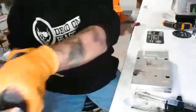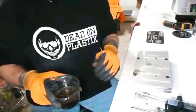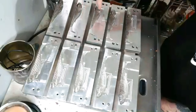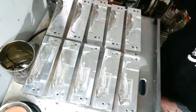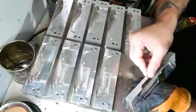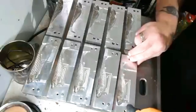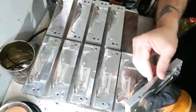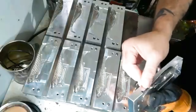We're gonna go through and get these ones all done real quick. Okay, we got the capsules all poured — you can kind of see it. We're about halfway down, not quite to the bottom of the belly. All the overspray that came off — make sure you pinch it off. Don't just yank it off or rub it off because you'll ruin your mold. Pinch all the way down, even when it looks thin, make sure you still get all the way down.